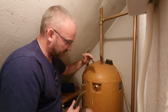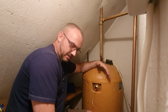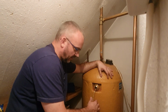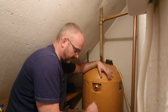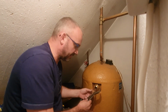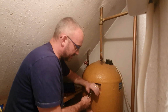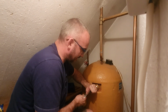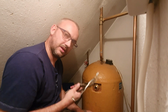Right, okay. I've seen people do this two ways. Firstly, bearing in mind it's only metal inside here. There are no actual working or moving components inside the cylinder. I've seen many people just let this go and drop into the bottom, which is not something I really want to do. You can pull it through. It's a bit tricky, and you've got to try and get that balance between feeling the wire bend, using enough brute force, but not so much that you're going to bend the cylinder. And I've just done it, just there, and that's now out.